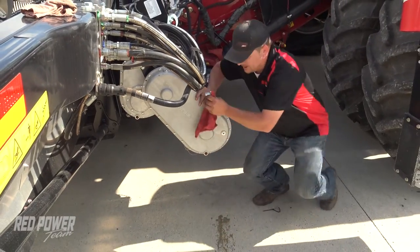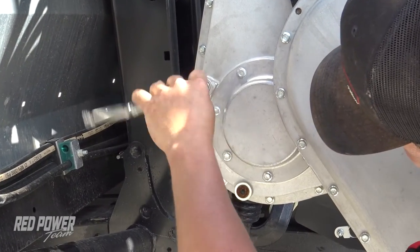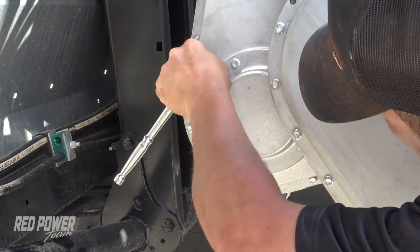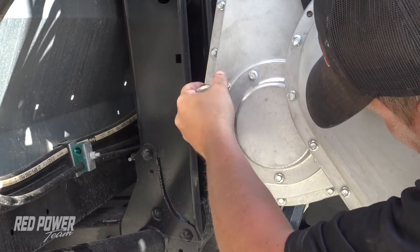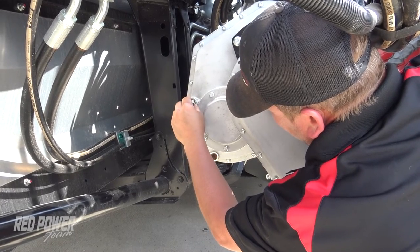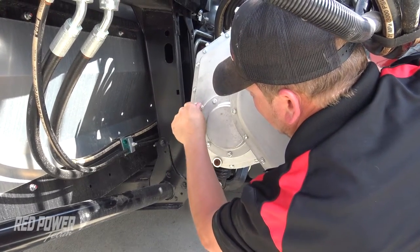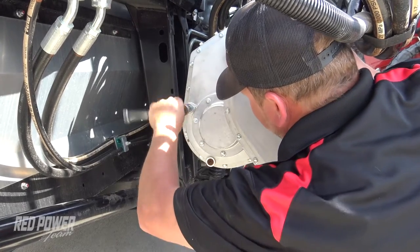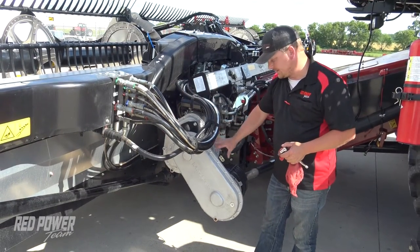Our next plug to check is up in front on our main gearbox. Again there's an O-ring on the inside of this plug that we want to make sure we don't damage as we're taking this plug out. They like to be seated in there from the factory, so I like to help it out with my finger and then they pop into place. We want to make sure there's oil right at the bottom of the plug — and as I look in there, the oil is right at the bottom. So we're going to put this plug back in — our main gearbox has oil in. We've just finished checking our oil off the two plugs off the main gearbox and our chain case.